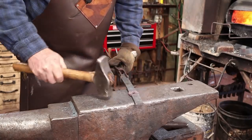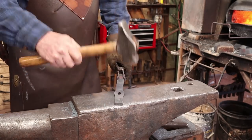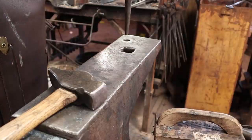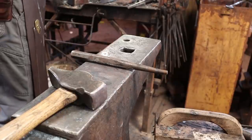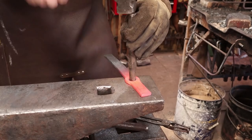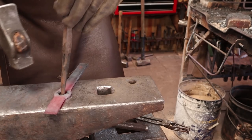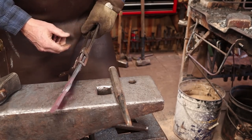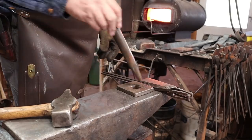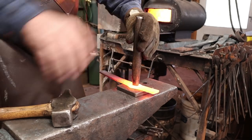Even though that's a little bit frustrating because it moves around so much, you can see that it's opening up, it's a little bit rounder, and that's going to drift better as a result. My next step is going to be to start drifting this — I'm going to start with just a round tapered punch. I'm going to check how far that goes into my pritchell hole so I don't drive it in far enough to get it stuck. That goes a lot easier because we took the time to upset that a little bit, and next we'll go to a much bigger drift. This one fits through the hardy hole and into my one inch hardy adapter, which gives us more support to the ring.